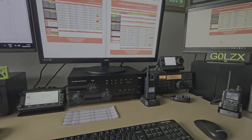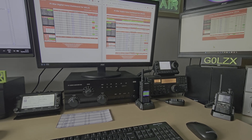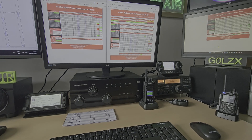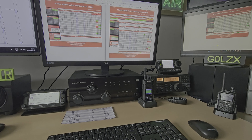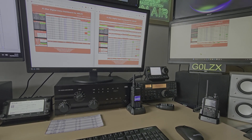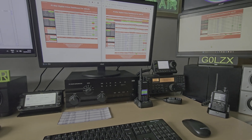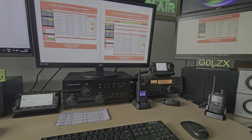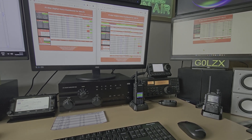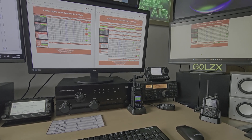There are other ways to listen to digital before making your choice - you can go online and monitor digital transmissions on various websites. If you can try two or three different setups, go down that route. You can use one hotspot for all three modes switching between them, but I find it awkward if someone's using one mode and you want to transmit on another. For the sake of buying another Raspberry Pi and hat for £40, having separate hotspots is simpler and easier to set up.